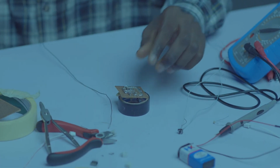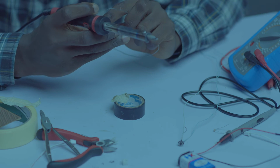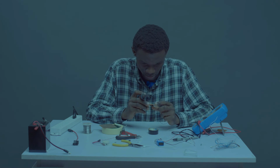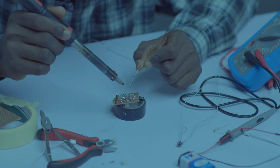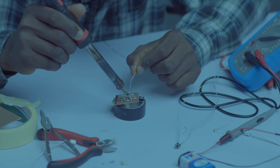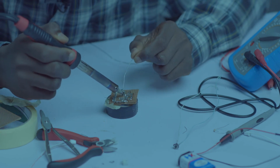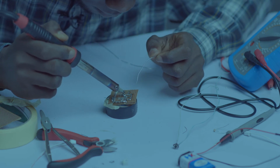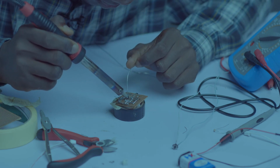Then switch off our soldering iron. We have our pin 4 hanging. So we have to take our pin 4 to pin 8 to connect to the positive. Let's look at the positive rail. Okay. Let's bring it in carefully. Carefully. Okay, you're good with that. Let's keep going.